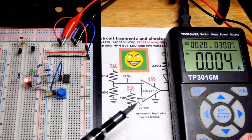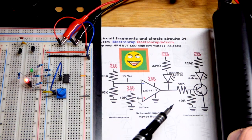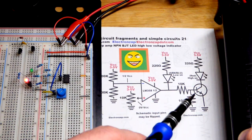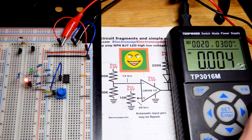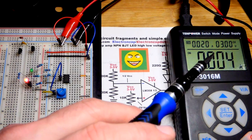In this video we're adding a transistor to the output of an op-amp so that the output basically just has to tell the transistor to turn on or off — it doesn't have to power the load itself. The reason is because we're not using much voltage right now.